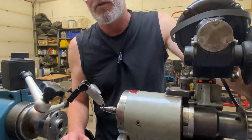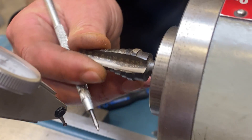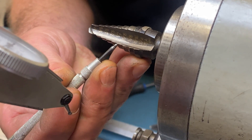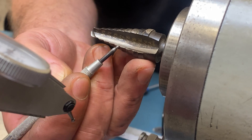The bottom line is, as long as there are reliefs and clearances on there, it will cut. Next step: I'm going to rotate this whole fixture to get this angle here running zero, and then I can read off the graduations on this fixture to see what the actual angle is. Then I'll know to dress that angle on my wheel.